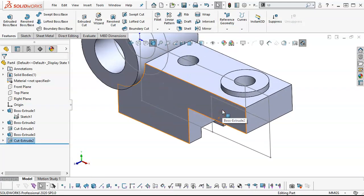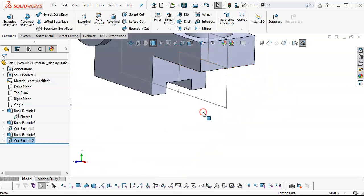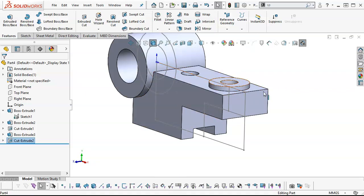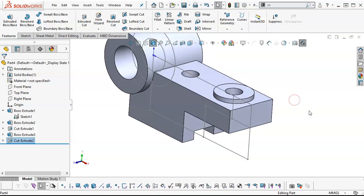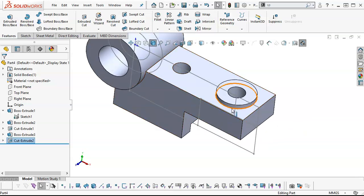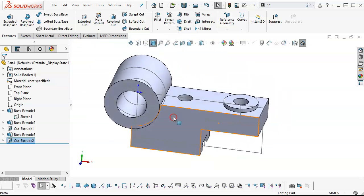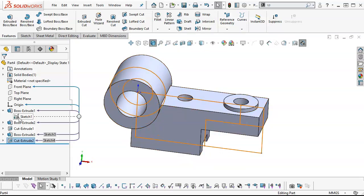Alright, so again, if I'm machining this and maybe I need the spot face, my choices would be, is it really an advantage cutting that? Is there some kind of clearance this needs? Can I use a longer bolt or screw over here and get the same result? Alright, so if I eliminate the fillet here, that's going to lend itself to our manufacturing process, but if I need to blend this, then I will probably end up blending along that edge and the lower edge.